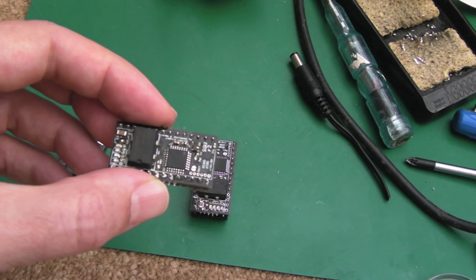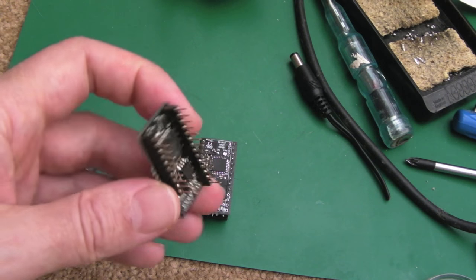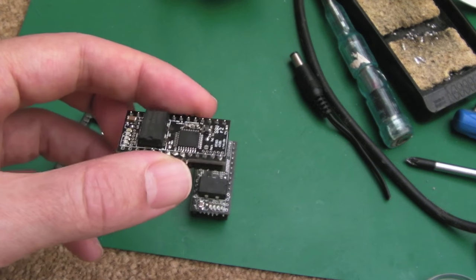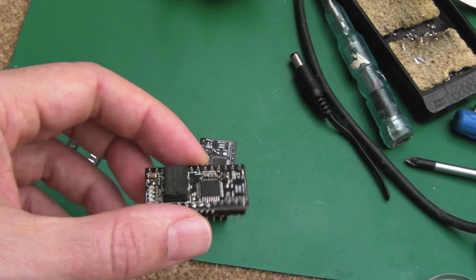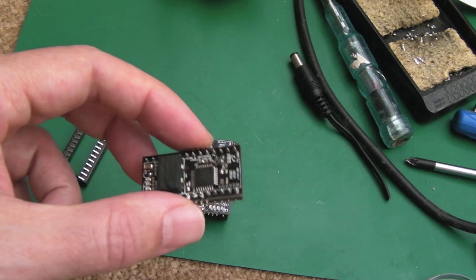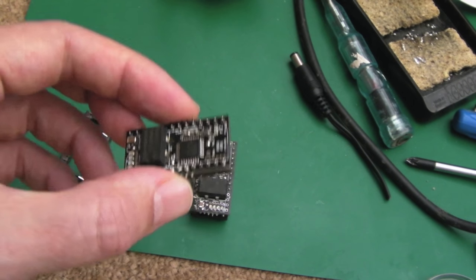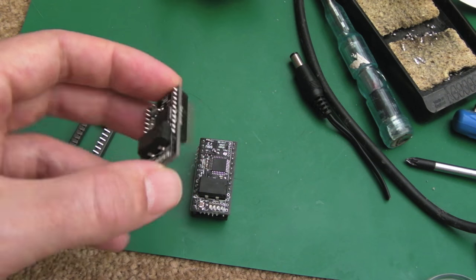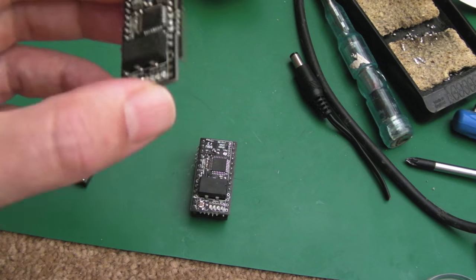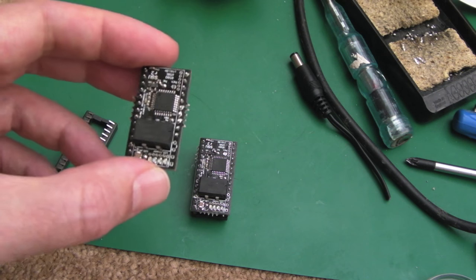Proper 23-bit noise waveform calculation, which is interesting, because I think that was one of the things that Bewak mentioned, and it was Bewak actually I've got to thank for getting me onto these. I didn't know of these until Bewak uploaded his video, and I think he was talking about the Lazy Jones fix initially. But one of the things Bewak mentioned was the noise generator was not very accurate on the original Nano SwinSID. So there's a better 23-bit noise waveform calculation there, so you get better random numbers.